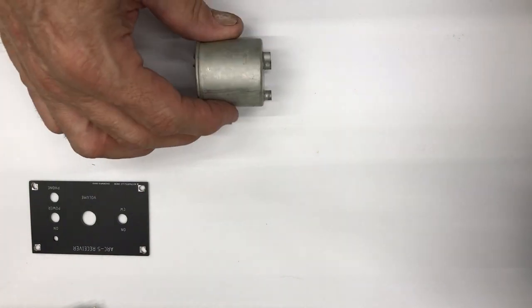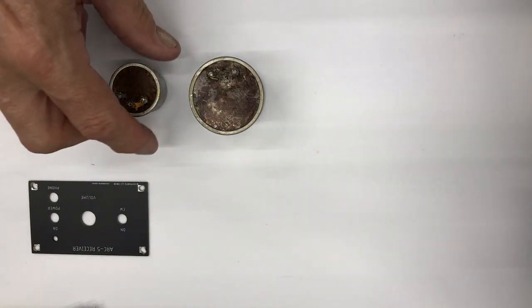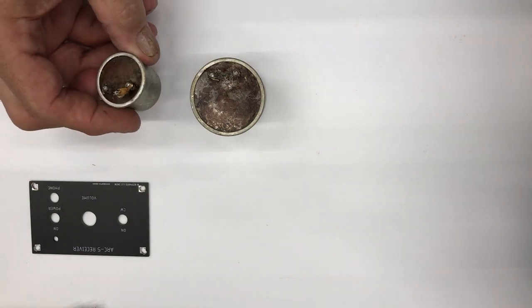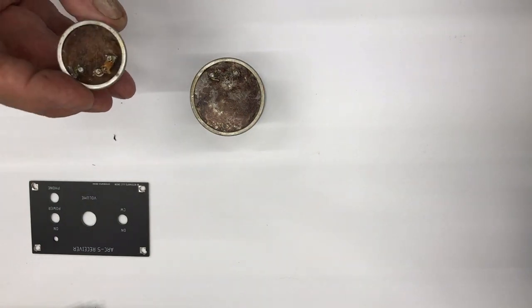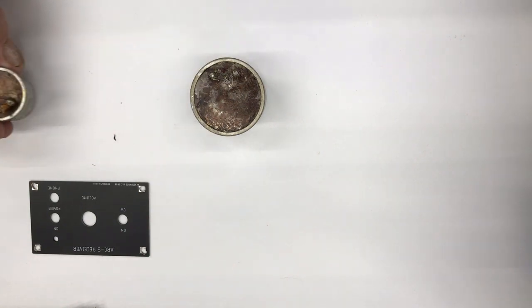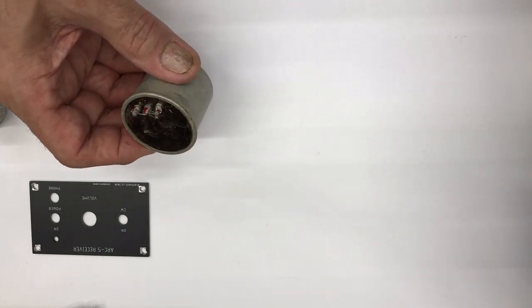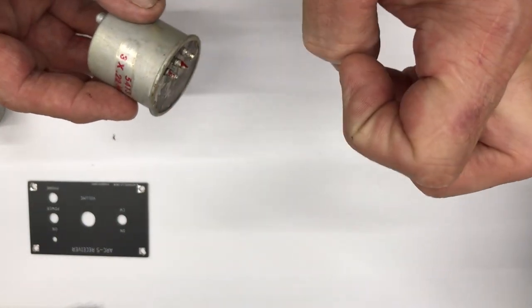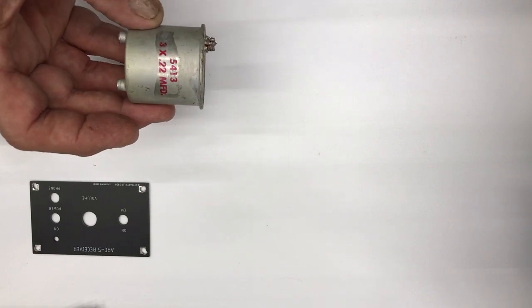One of the common problems when converting an ARC-5 is the replacement of the existing Sprague capacitors. These were pretty unique — in an extruded can with 3-48 studs on them, which is kind of halfway between what we use today. There's also a Micarta top. Most of these were made with beeswax during the war because of a lack of paraffin — paraffin was needed for explosives. So one of my challenges in the past was to remove this cover very carefully, or take a jeweler's saw, cut it out, clean it out, put new capacitors in, and epoxy it back together so you'd have something original.